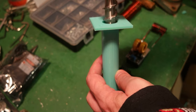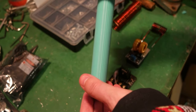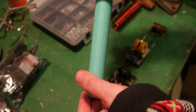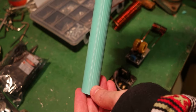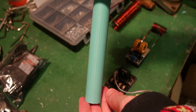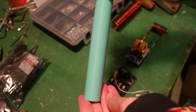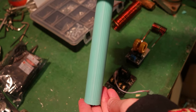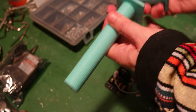With a heater block, you're heating externally — only the tube, not internally. The drill bit doesn't directly touch the tube, so it gets heated but not as much as the tube or the aluminum block. Keep in mind that the tube and all components will be stainless steel, because I'm printing carbon fiber and it needs to be abrasion-resistant.